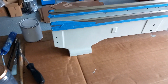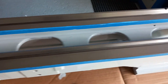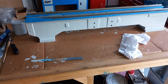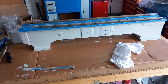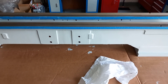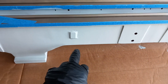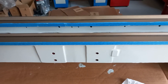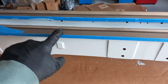The bed has had a first coat of paint and now needs a bit of rubbing down. It's tricky because you can't do it all in one piece — you have to keep turning it over. That'll probably take another couple of weeks; no rush. There's 15 hours between coats, so basically you put a coat on and leave it for the next day. I've also bonded two aluminium pads in to take the DRO scale, making sure these are perfectly aligned and square with the surface.